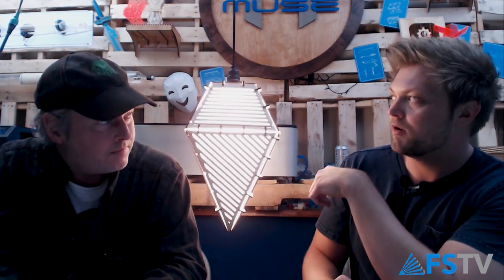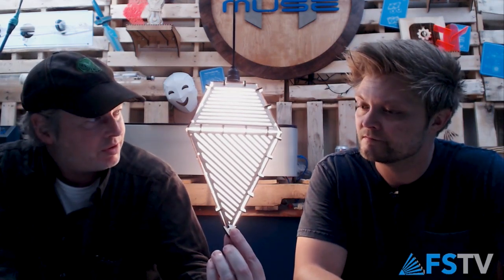The settings on the Pro: we cut at 60 speed, 100 power, and 80 current. Running your Pro, this takes probably an hour realistically to cut. About $8 worth of wood. This is quarter inch — and remember that quarter inch is never true quarter inch. Most of the time it's .2 inches. If you want tight notches with wood, you'll always want to drop that two decimals, so .18 is good for notching projects. With acrylic, you'll probably only want to drop it to .1 or not at all, because it cuts so precisely.